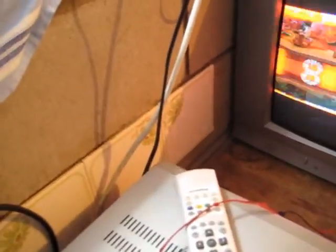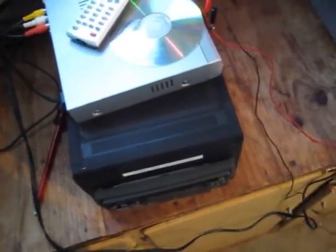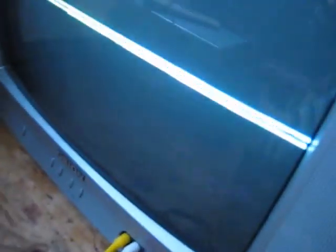I'm going to try a different CD now. I've got a bass test CD. Here we go — frequency test change, this will do. That track's almost pretty bad. I'm running out of memory so I've got to stop the camera. OK, let's pick up where we left off. I'll change to the bigger card now. This is a 1 hertz sine wave I think. 1 hertz makes the lines scan very slowly and you can see the picture being created. It's pretty cool. Gives you a fair idea of how the vertical system of your TV works.